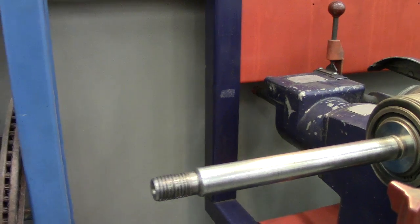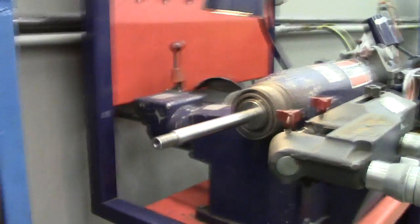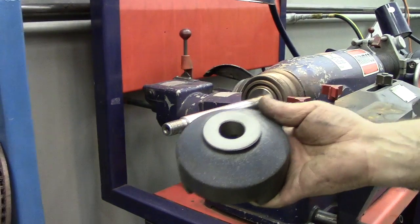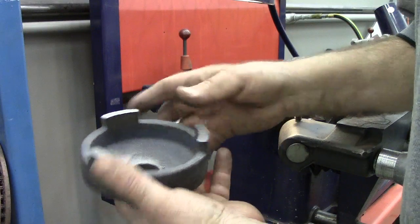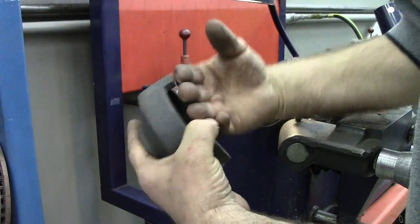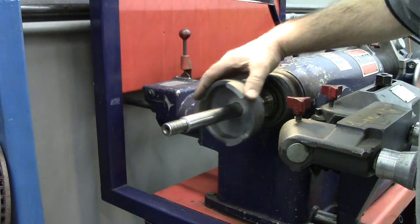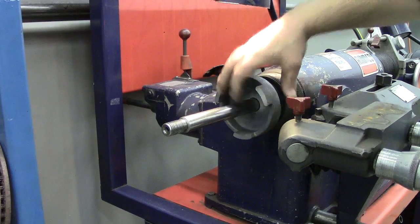Next, let's do a build up or a stack up of the devices that would then allow our rotor to be mounted. We said before that we're going to have a hubless adapter. And on this hubless adapter, again, I went through the other day and I machined all the surfaces on this. So off of squareness off the back, this surface and this surface, as of right now, square until someone drops this on the floor. Of course, we're going to slide him back the whole way. And he's found his centering ability by being pushed back.